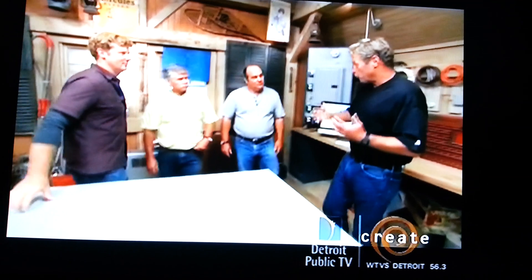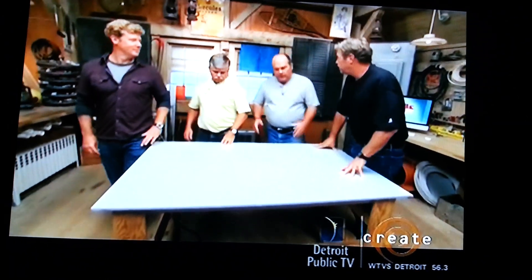That's really cool technology — well, it's pretty cool, but it's not exactly new. In the commercial refrigeration world, they've been doing this for years. You walk into a supermarket and you see a bank of freezers. Somewhere in that building, all the heat taken out of those freezers is being dumped somewhere, and they've been able to creatively reuse that heat to their advantage. You can actually take that heat and use it to heat other parts of the building, or even heat hot water for faucets.